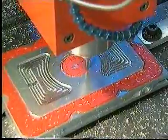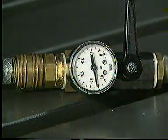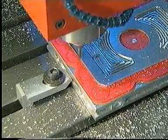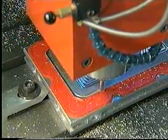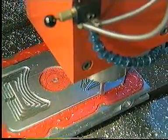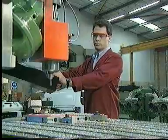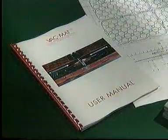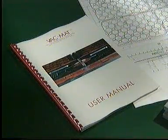Its performance is also unaffected by swarf or coolant. The vacuum gauge shows 0.85 bar or 12 psi. In the application demonstrated, the pump enables more than 50% of the Vacmat to be open to atmosphere. The vacuum is always monitored and can be interlocked with the machine control, therefore being completely safe in use. The Vacmat user manual gives all the information needed.